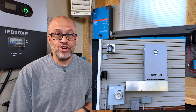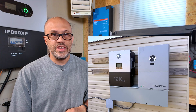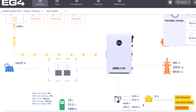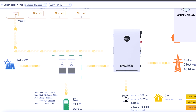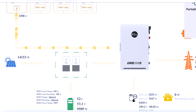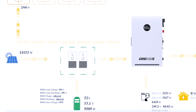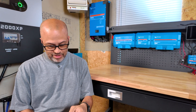I have a Grid Boss right now, a Flex Boss 18, and the EG4 12k PV. Both of those hybrid inverters are going into the Grid Boss to power my system. I've got quite a bit of solar going into those — about 28 SolarEver panels, 12 Hyundai 305-watt panels, and then five or six panels on a small ground mount. That's another 1,600 to 1,800 watts. Let me go ahead and look at my numbers on my phone so I'm not messing these up.